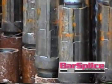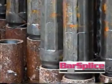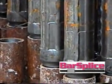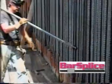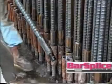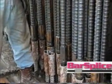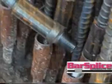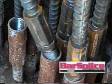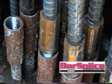The Type 2 taper grip twist system can be used in stadiums, bridges, dams, power plants, and high-rise structures for normal and seismic loading. Type 2 mechanical splices in accordance with ACI 318-99 are permitted at any location. The Type 2 taper grip twist system does not reduce the cross-sectional area of the rebar by a threading operation of the bar. Specified ultimate tensile strength capacity of the bar is maintained at the point of entry into the connecting device.